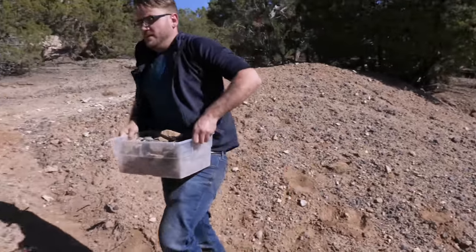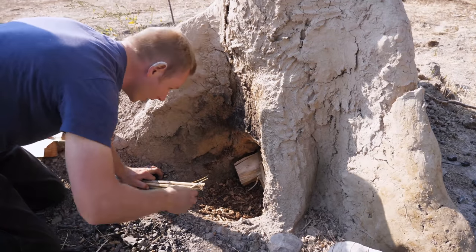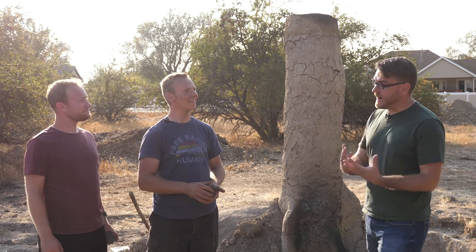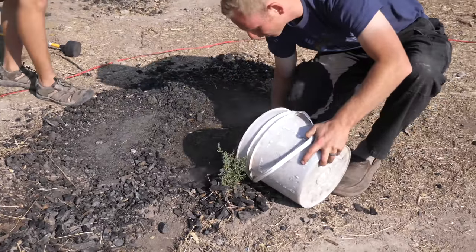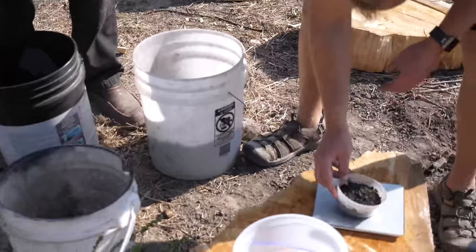Now with a source of iron ore, I met up with the Josephs. I did my iron smelt and it wasn't the most successful — I did make iron, but it wasn't very workable. They have their massive furnace they've done at least four or five times now and it's survived. With a smelt like this, you typically layer it with alternating layers of ore and charcoal, just like I did — two to one charcoal to ore by weight, with charcoal going in first.